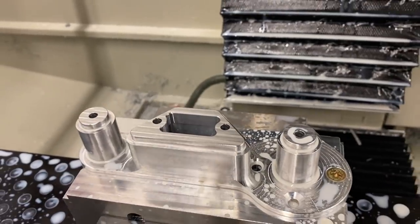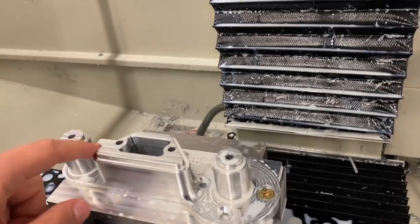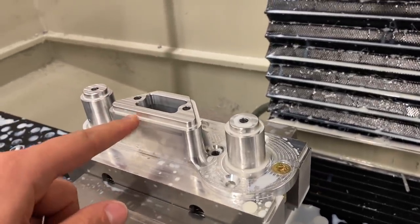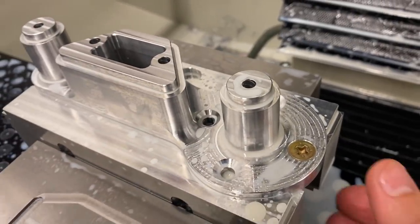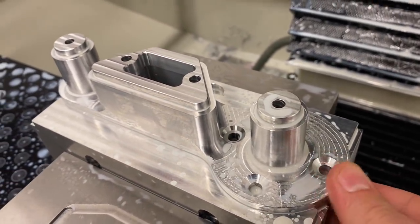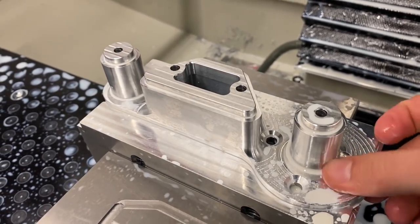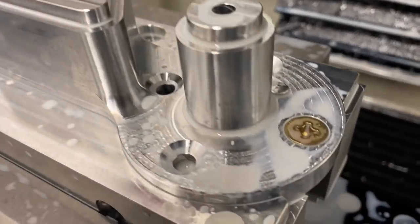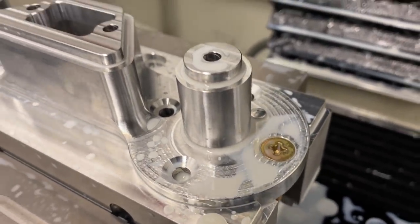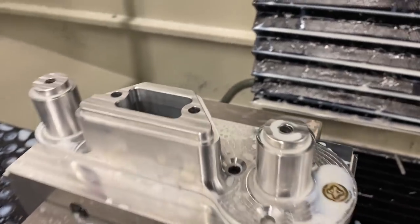So we just finished the side two final machining operation for the outer link, the right side, or the right landing gear. We're checking a couple dimensions to make sure everything looks good. Just did a trial fit up with one of these machine screws. It goes in there pretty good. But one thing that I wasn't fully certain of in the CAD was the depth of my chamfer. And this is just sitting slightly proud right now. So I think we're going to go back for a second pass on the chamfer. Just take a little bit off to get that so it's not sitting proud. But looking good